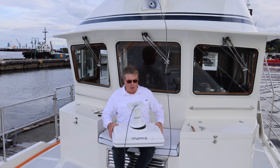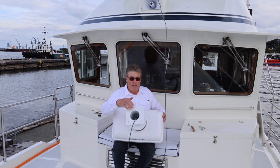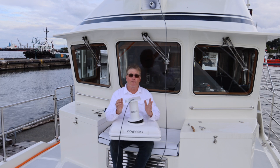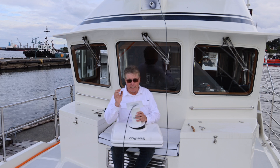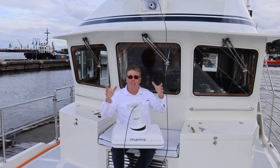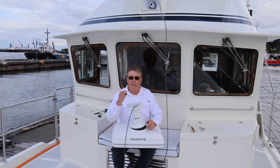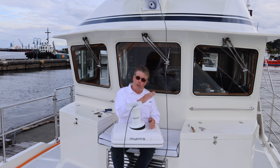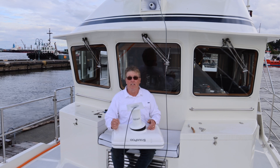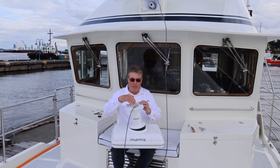We have it all positioned well together. Down the middle is the tube — the actuated tube. On the new flat mount one, you don't have that. But on this one it has enough clearance so when that tube is straight up and down, it still fits within this angle. When you get the new actuated and you turn it on, it starts in STO mode and will go ahead and center itself before it starts hunting — so unplug it right then. If you miss it and it starts hunting, click it back to STO mode, which puts it at the shipping angle. Then undo STO mode and it will go straight up and down, then just unplug the router. You want to test out your Starlink before you put it into the Starpod — just get it straight up and down and it will fit right in there.